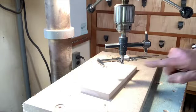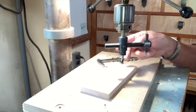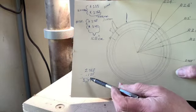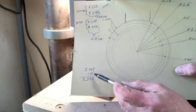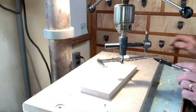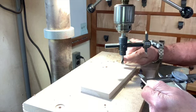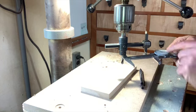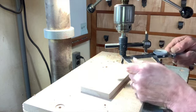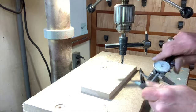To set this up, I just need to get the dimension correct between the point of the tool and the edge of the tool bit. That requires some subtraction: two and four hundred and sixty-eight thousandths minus half the center drill dimension at one hundred and twenty-five thousandths, leaving two and three hundred and forty-three thousandths of an inch to set up. Drop your bit down far enough so you can measure between the drill shank and the cutting piece. Be prepared to tweak after tightening the Allen screw. I use a dial or digital caliper.